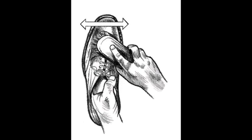Tips: don't clean windows in direct sunlight. It heats the glass and promotes streaks. A 12-inch squeegee is a good size. An 18-incher covers a lot more territory but can be unwieldy. If you have divided light windows with multiple panes, you need a small squeegee to fit inside the grills. Measure the window before you buy.